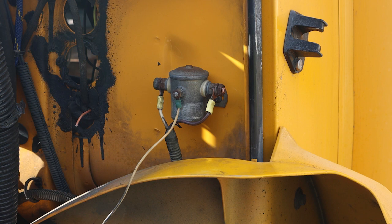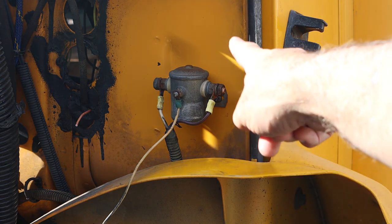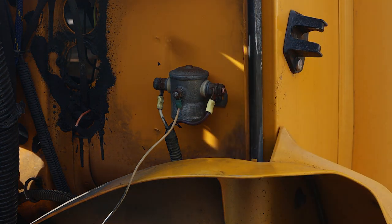What they've set up is an interlock system, and on each door if you go into your bus and look, there should be some type of a latching system that allows the doors to be locked from the inside. There's also buzzers and things in the same circuit. If the bus driver tries to start the bus with any of the doors locked, the engine won't start, and this relay is part of that interlock system right here.